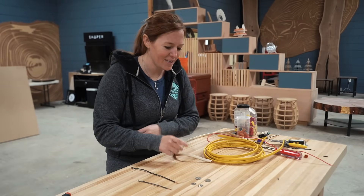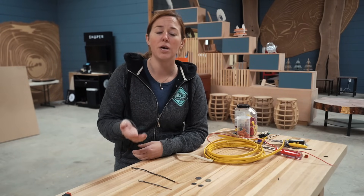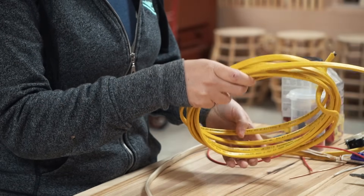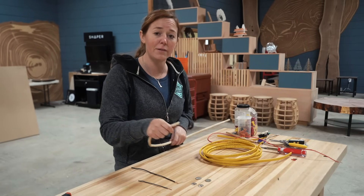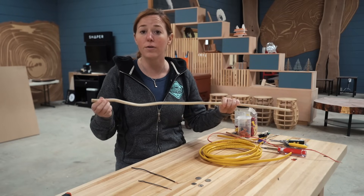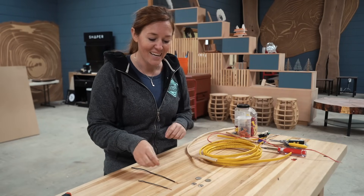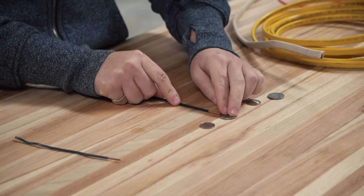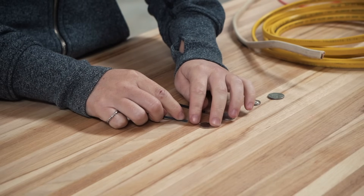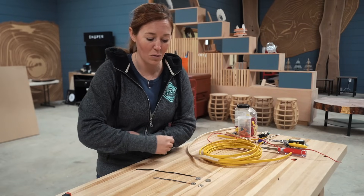If you're adding something to a circuit, you need to choose the correct gauge that already exists in your walls. Newer homes have color coding to visually indicate 12 or 14 gauge, but if your house is 15 years or older, you likely just have cream-colored wire with no indication. A good way to test: 14 gauge wire is about the same thickness as a dime, and 12 gauge wire is the same thickness as a nickel. Just strip some back, lay it flat next to the coin, and you'll quickly know which wire gauge you need.